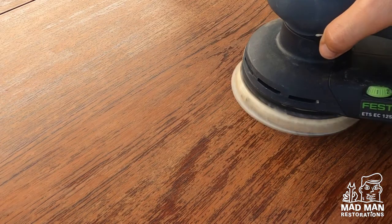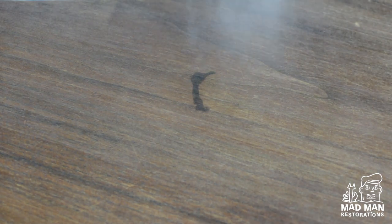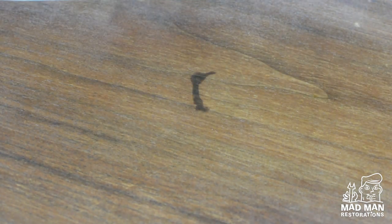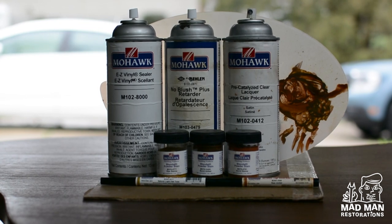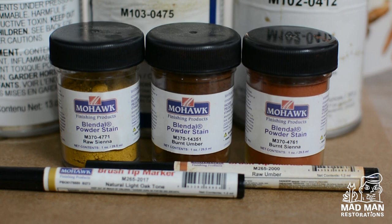I forgot to record myself sanding this table, however when I did sand it, imagine it looks something like this. Now it's time to address the ink mark — first things first, I'm going to spray a quick coat of vinyl sealer. These are the materials I'm going to use to disguise the mark: vinyl sealer, blush retarder, lacquer, pigmented powders, grain pens, painters brushes, and the palette. The technique used to disguise these marks is called in-painting. I get asked a lot on social media — I would not say the technique is hard, but it does take a lot of patience and practice to get it done correctly, and I do plan on making a more detailed video about this in the future.